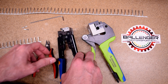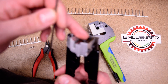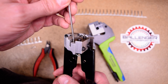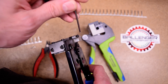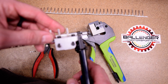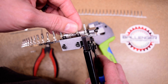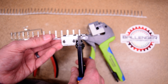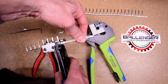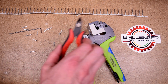Beyond that we've got a Tyco tool here. This one has several adjustments — you can change the gates which will adjust the depth, basically the height of the terminal that passes through. This part will adjust it back and forth and this part will adjust the terminal-to-terminal sizing. Here's an example of use: we put it into this TE hand dereeler and as we use it we're cutting off one at a time. It goes pretty quickly. That's a big improvement over the simple snips.